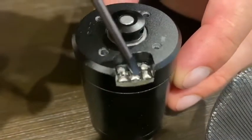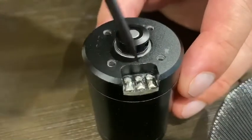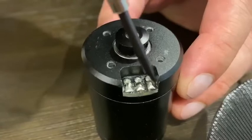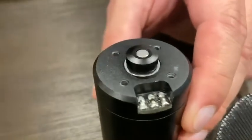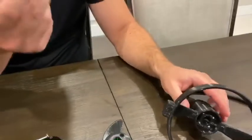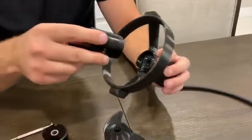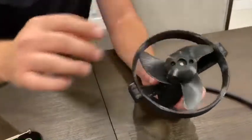there's a solder pad where we solder our wires on. Once we solder our wires on, we can simply fill this entire slot with epoxy and waterproof it. Once all the electrical connections are waterproof, we simply put it into the thruster casing and can use it right away without any issues.